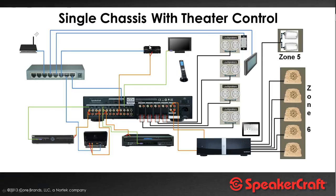There is a surround sound amp connected to zone 5, so any of these sources can switch through the MRA into a single input on the surround sound amplifier through the control capabilities. There's an IR emitter connected to the TV so I can control it, and the surround sound amp is on the network — so I'll be controlling it using IP control, which most surround sound amps tend to have nowadays.